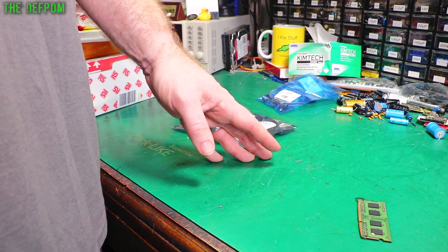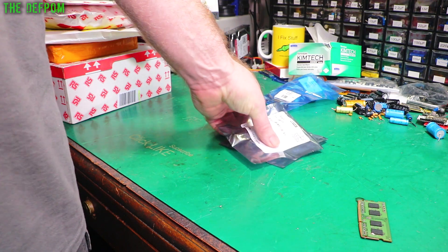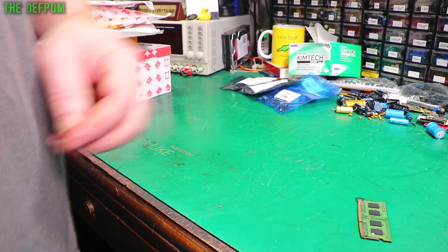I've bought a selection of different ones and I'll just have to revisit this and figure out which one I need to use for the HP 8165A which I'm currently repairing. It's got at least one bad reed relay in it that needs replacing. I just don't know which one it was - I'll have to re-look at the specs. It has to be a shielded version; there's a shielded and unshielded version and the one that's in there now is a shielded version, so I need to make sure I use the same one.